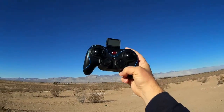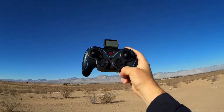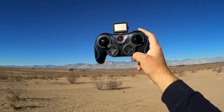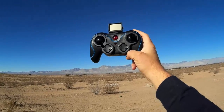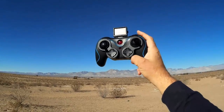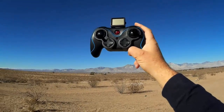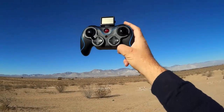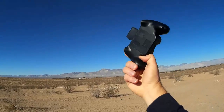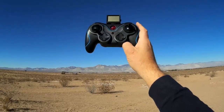Now another thing: I was getting mediocre ranges with the base transmitter. I was getting great ranges with my WL Toys transmitters, but with this stock transmitter that comes with the quadcopter I was only getting out to about 60 meters, when it's advertised at past 100 or 200 meters. So I opened it up and sure enough the antenna was miscut — not the full 31 millimeters for a quarter-wavelength 2.4 GHz antenna, only about 23 millimeters. So I soldered on a simple wire extension last night, left it inside the case, to see if that improves the range.